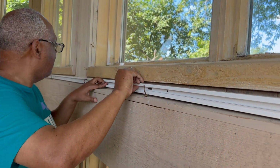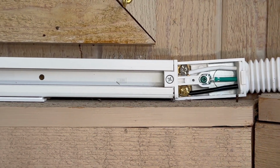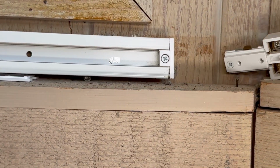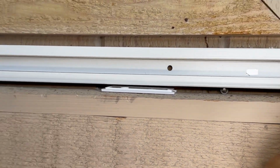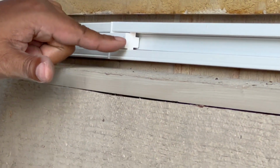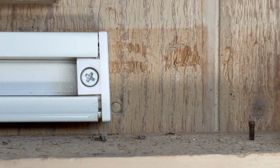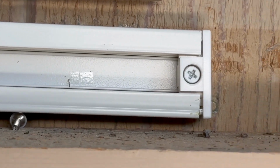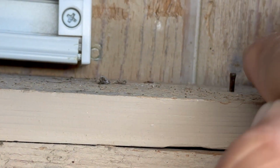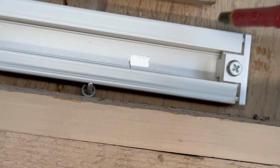Okay, so I'm here with my friend Danny Baker. He's helping me, and he's holding it. I'm gonna push it from this side. If you notice, I have the end piece, the end cap. It always helps, because sometimes if you don't use the end cap, the copper track, the contacts come out of the end, so that end piece helps to keep it in place. If you notice, it kind of wants to get out of the bottom right there in that crack, so that end piece is helping a lot. Always push your fitting with an end cap.